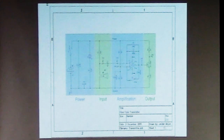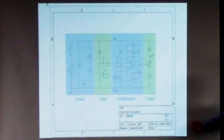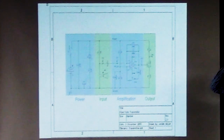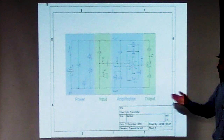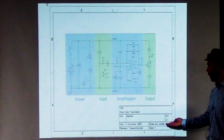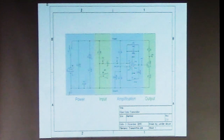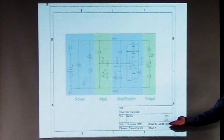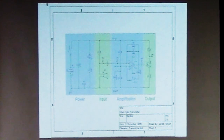There's also a revision number here—this is revision 2.3. Circuit boards often go through various iterations and changes, so you might have different versions of the transmitter circuit. This is maybe the seventh or eighth design for the transmitter board. It's important when looking at a circuit diagram to make sure you're looking at the diagram for the correct revision. On your circuit board there should be a revision number you can match to the title block.